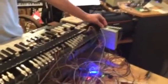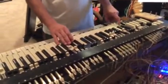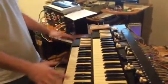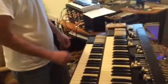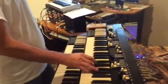We have a program mode that we can flip it into, and in program mode you can change the MIDI channel. So now we're on channel 2. Now we would be on channel 3, but I appear to have nothing. There we go, so we're on bass pedals. The first 16 notes set the MIDI channel for the manuals. I'm going to set the top one on channel 1, the next one on channel 2, and we'll go back out of program mode. So we're on top manual, bottom manual.